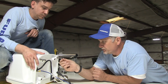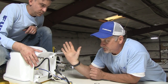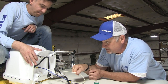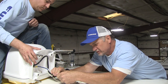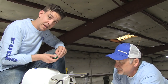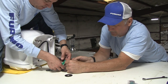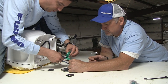We've got the studs supplied with the gearbox inserted with a little bit of never-seize so they won't have any problems. We're going to drop the gearbox right down into the existing holes — no drilling required. The permanent messenger is taped up and secured in case we need to use it again. Now we're going to connect the radar cable, which is really simple — just make sure it's tight and connected. It's a simple plug lock, and it's clicked. Then to add extra waterproofing and security so it doesn't bounce loose, we're going to electrical-tape this and wind and seal it to protect it against the elements in case water gets underneath the gearbox over time.